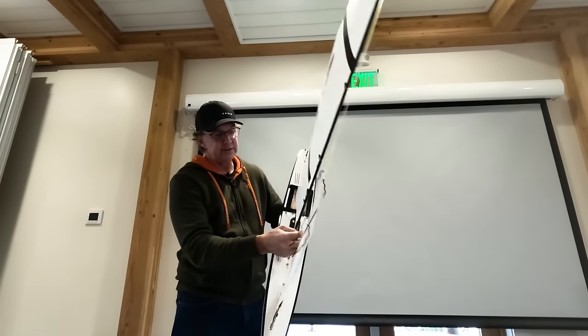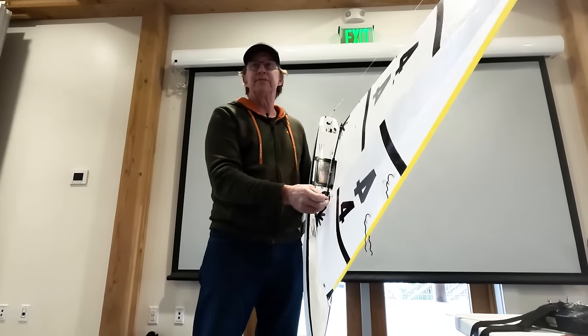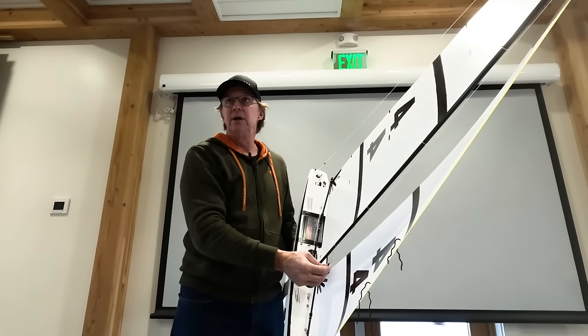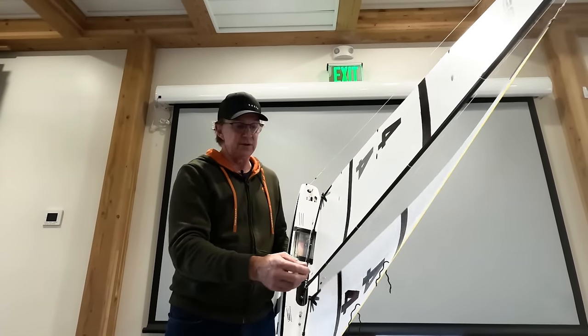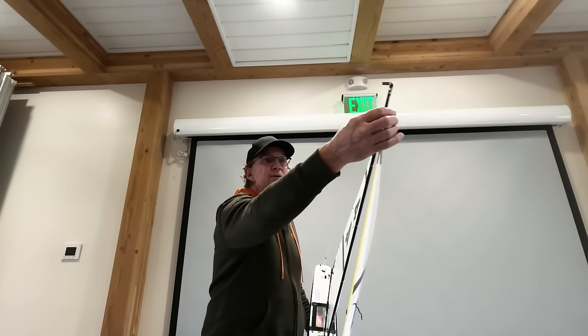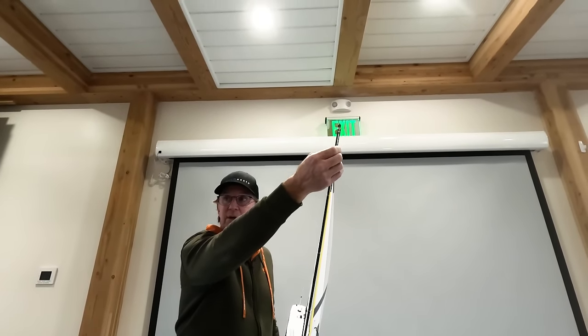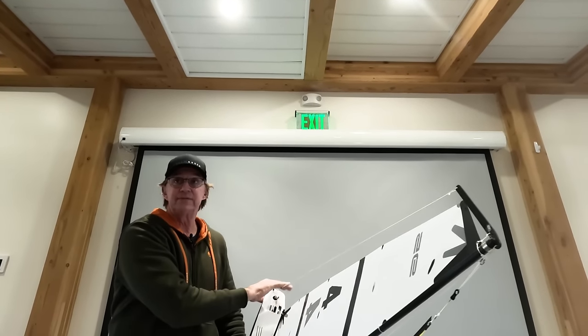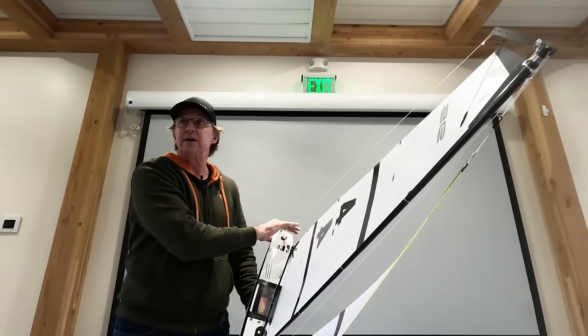and that's the topping lift. If you change the rake, you have to change the topping lift. If you change the topping lift, you're just on its own, fine tuning the twist. But when you make even a 2 or 3 mil change to the headstay, technically you don't have to change the backstay, if you have it right.